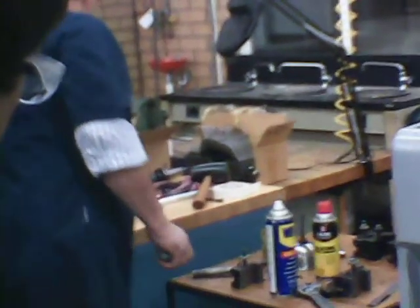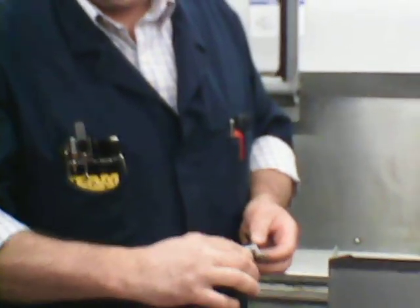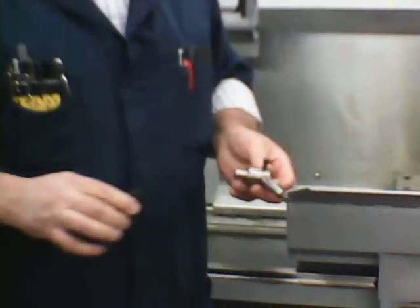The problem with the heavier cuts, though, is you don't have a lot of options on where the cutter can actually fit. See, this one will fit up a lot closer to this corner than that 80-degree insert would. So they call these profiling tools, and those are turning tools. You don't need to remember all that. It's just really nice to know from something like this.